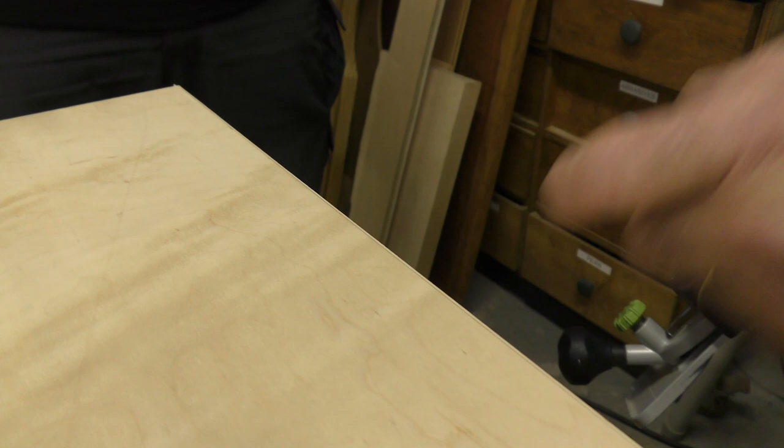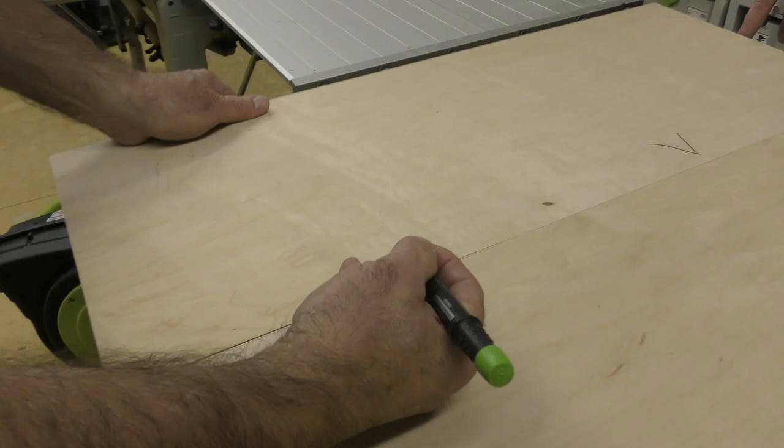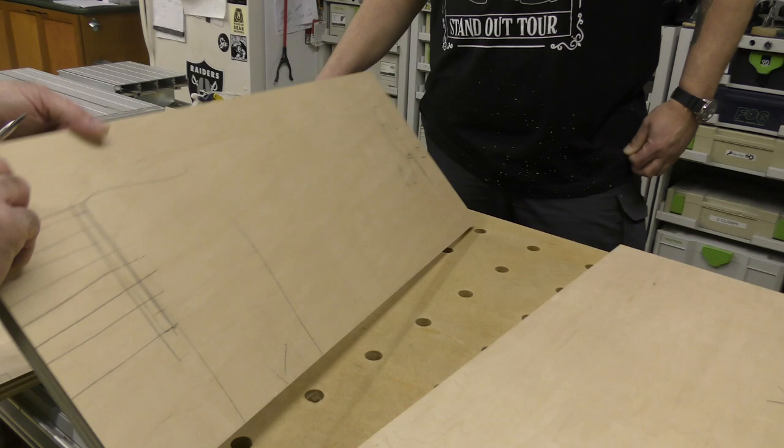To check if the edge is perfectly even, run your fingers along it — that's what we want. The true test for edge banding is taking a fingernail and scraping across it; you can feel how perfectly flush it is. Now I'm going to scribe a line because we're going to groove the back for our cabinet back. The difference: a dado goes cross-grain, while a groove goes long-grain.